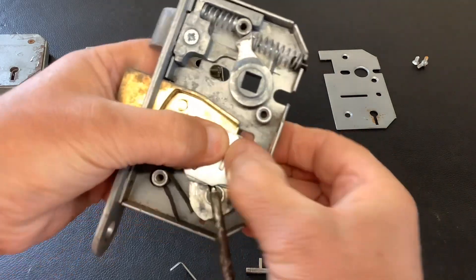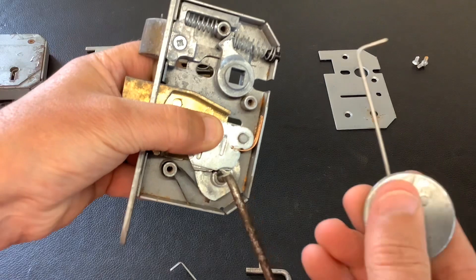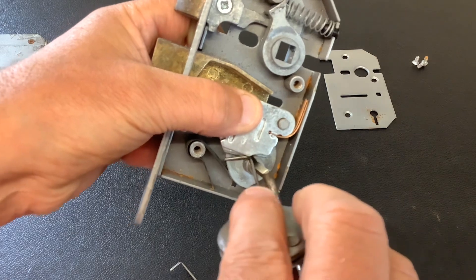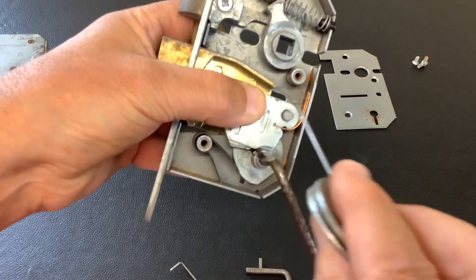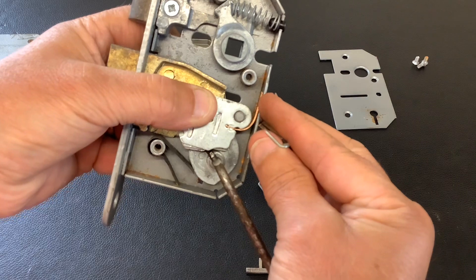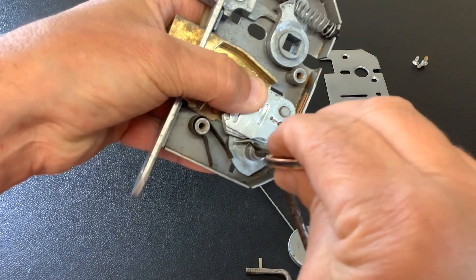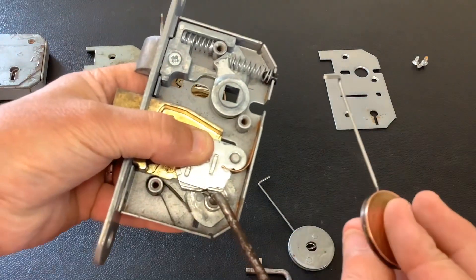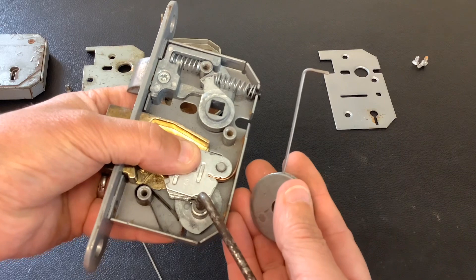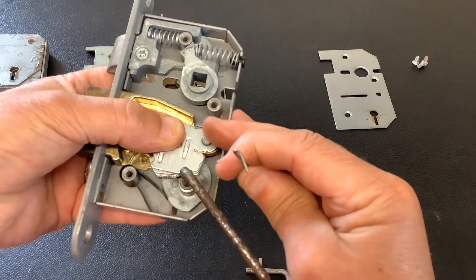That's got tension on it now. If you were to put your wire in without a kink on it — the type used for non-curtain locks — you wouldn't get it in, because it needs to come around the curtain. So it needs a little tiny bit of a bend on it. When you're making a wire for a lock with a curtain, you need that little bend so it sits over and goes underneath all the levers. On a lock without a curtain it can just be a straight 90 degree bend, but the curtain lock wire needs that little kink. I've done videos showing how to make these — you just put them in a vice and tap it a couple of times to get that little bend on it.